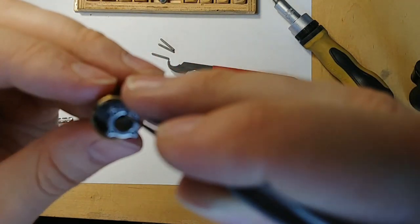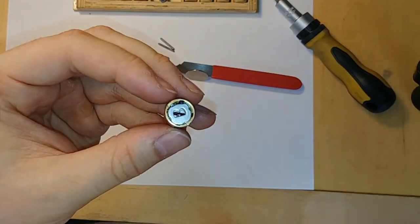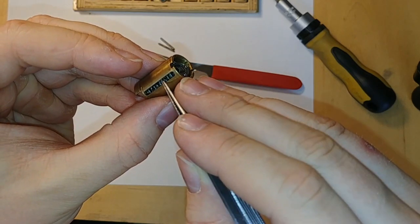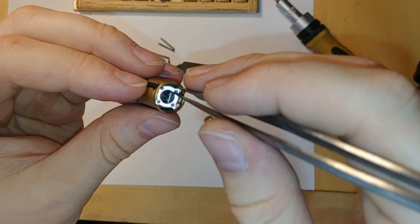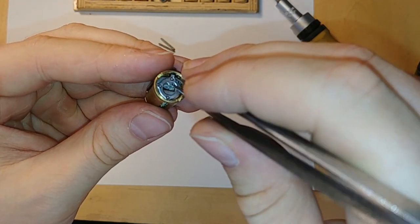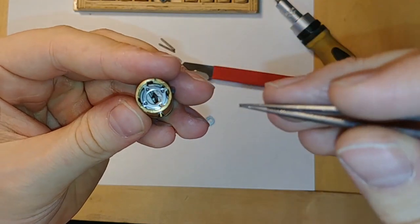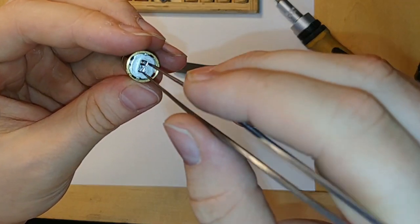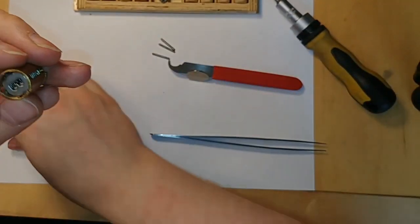And here's another tip. So if you have the black sidebar out, there's a high chance of rotating some of the wafers or washer discs in here in the wrong position, so you can't get the sidebar in again, and then you have some real trouble to get this aligned with every groove. So you have to have the wafer really aligned with each groove in here to just turn it a bit, and then you can enter this black plastic sidebar again to keep it in place. Then you just put the final disc on. I think it goes this way, but I'm not sure. Let's find out.